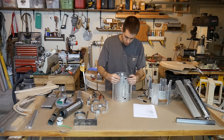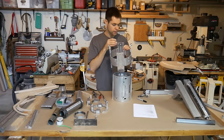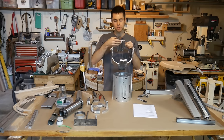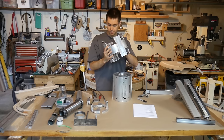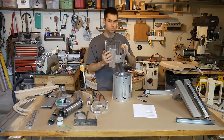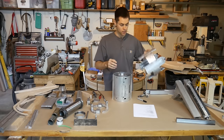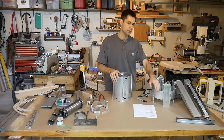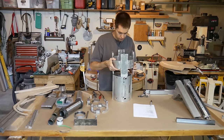What I ended up doing was to use just aluminum pieces for the verticals and then use some low-friction plastic on here. The plastic has a set screw which goes into it that can be cranked in or out. That gives you the ability to adjust your wear surface not just side to side, but also like this, because that lets you accommodate the variability in welding. I can also adjust the entire system in case the raising arms are not exactly 45 degrees to the other ones. It doesn't give you a lot of variability, but I can build it close and then adjust it so that it's accurate.